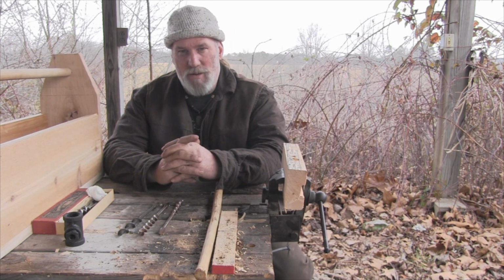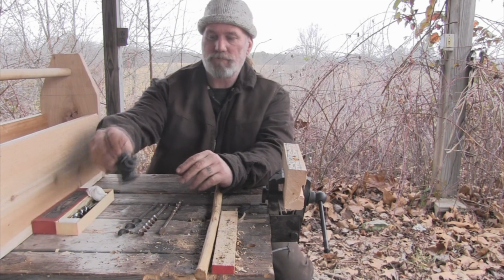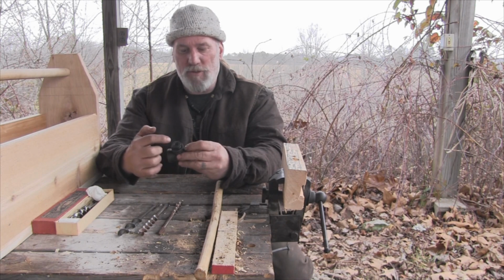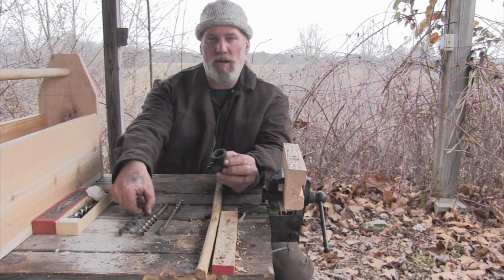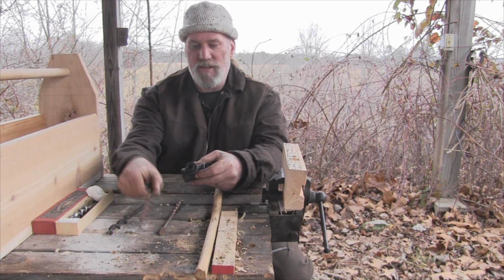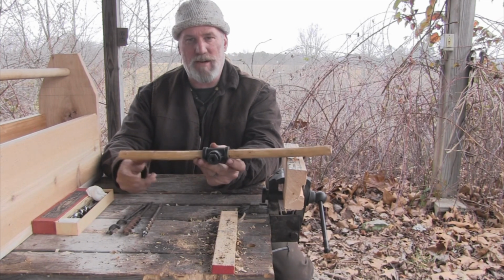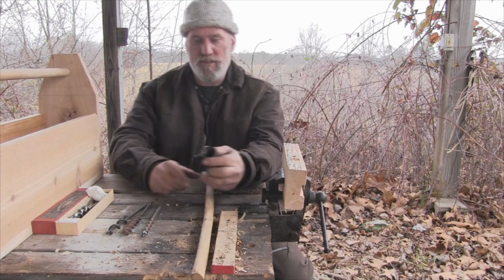So what's the answer to that? How can we make something to take to the woods that will adapt to these augers and work well for us? Well, I came up with this. This is a T-pipe made of black iron that is 3/4 inch inlet here, 1/2 inch inlet here. I took another reducing adapter that went from 1/2 inch to 1/4 inch and put it in here. And now we're going to heat this up in the forge, and we're going to pound it over the top of an auger bit to form it to a square from a round, so that all of these auger bits will then fit inside this single adapter. It doesn't matter what size auger bit I have or what brand it is, it's going to fit in there. Then all I have to do is cut the stick, slide it through the center of my T, and I have a portable and more versatile type Scotch auger. Stay with me, we'll get this made.